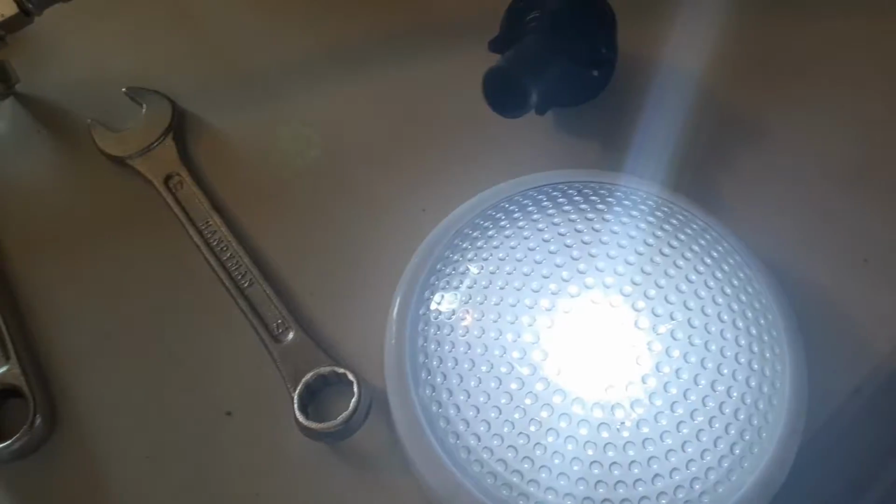This is a 1 1/8 hole saw. The sink didn't have a hole in it, so I put my own hole in it, okay? Of course, this is the apparatus that is run through. We're going to slide right through it, okay? All you need is a 10-inch to hold it down to help you screw. Nice little plumber's wrench. There's the 1 1/8 drill, this.